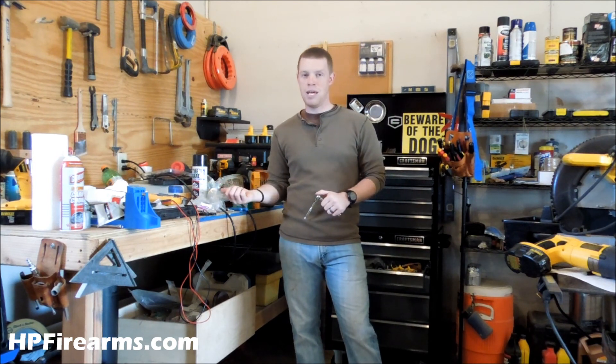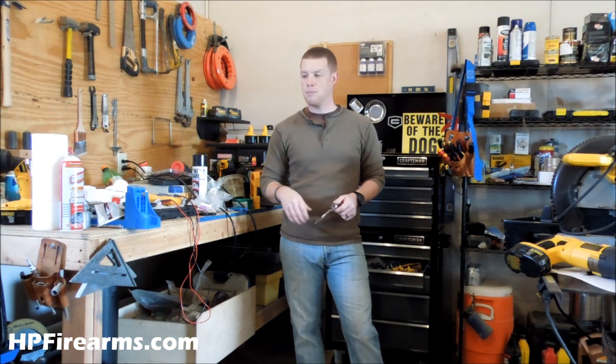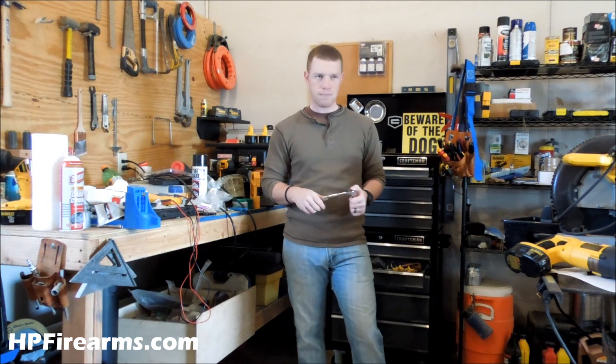As I tested on the bench — and you guys have seen in other videos — it will charge. If we get a good wind going, it'll charge. And even a slow wind, just barely turning it, you're going to get about 4 to 5 volts out of it. So what you need to get your 12 volts is a higher spin.